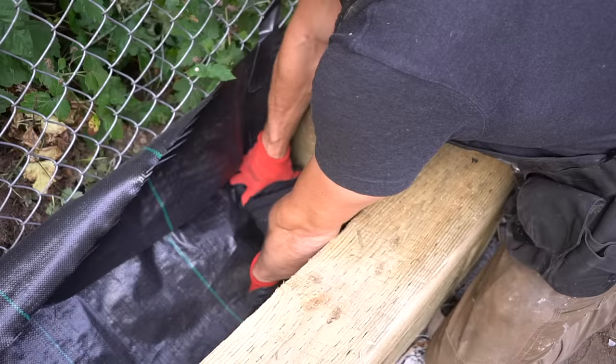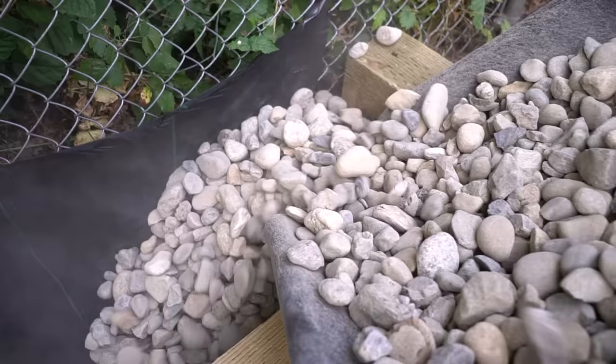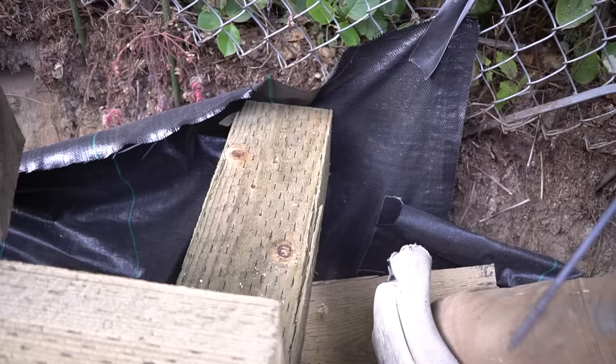At this point, with a helping hand, we started filling some rock into the smaller locations so we could bury the pipe and backfill the retaining wall with our drainage rock. It's another reason why it's nice to use rounded drainage rock — you can also use it as a landscape accent, and it's more eye-appealing than crushed drainage rock if it's used for a landscape purpose.